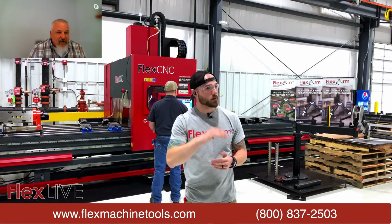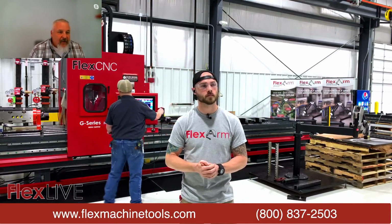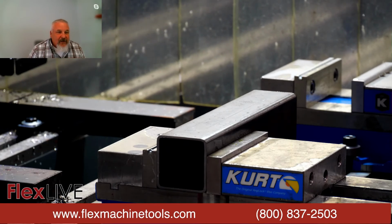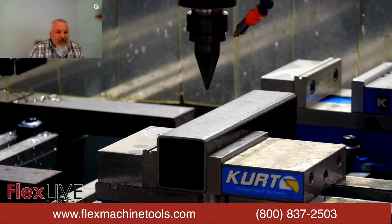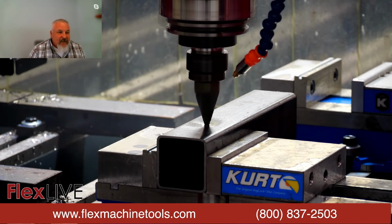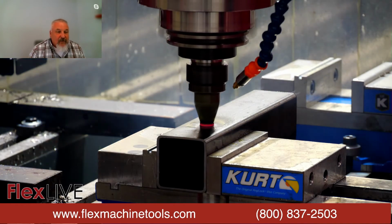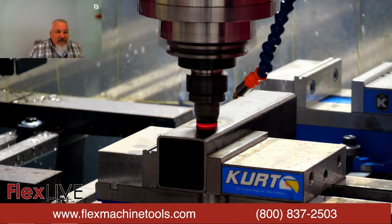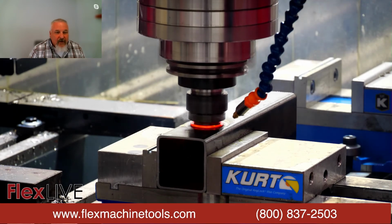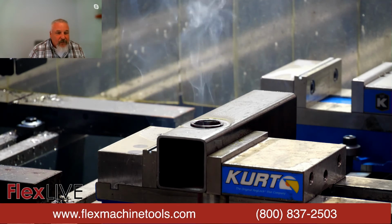I will say with the FlexCNC, we're seeing a lot more of our manifold customers who have long lengths of pipe, where before they were using a standard machine. They set it up on the length of the table in a FlexCNC, and you can put any length they need. So we have people with 10, 20-foot sections of pipe. Instead of doing multiple setups, they do one setup, flow drill all the way from one end to the other, and complete that part in one setup. It's really cool.